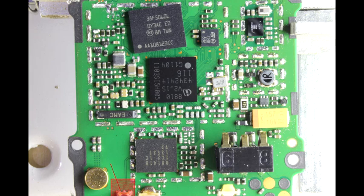In this rotated and zoomed-in section of the board, the little red splotch at the bottom is basically the RF input, which goes into the first chip — almost certainly the RF cell phone processing section. Above that is the application processor providing all the CPU functions. Above that is almost certainly some sort of memory storage device. To the right is a Bluetooth chip, and next to it looks like a little boot PROM.